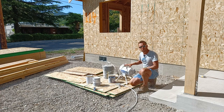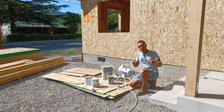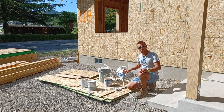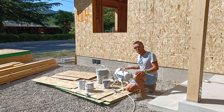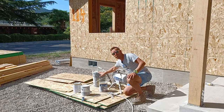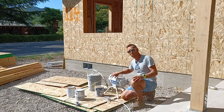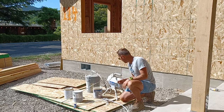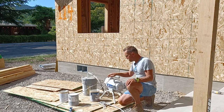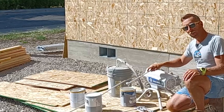Just a quick demo of this paint sprayer — I'll cover it in more detail when we're doing painting as a full task. This is a sprayer I bought from the local paint store — it's a professional grade Graco. I've got our intake line into the primer bucket and a sludge bucket where we take the discharge hose so we don't make a huge mess. First I'm going to turn the sprayer to prime, then turn it on until I see paint coming out of the discharge hose.